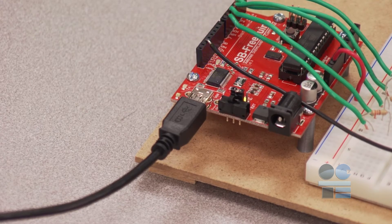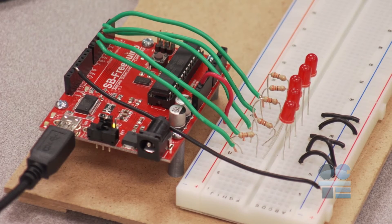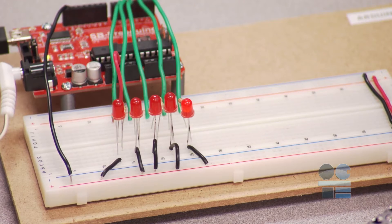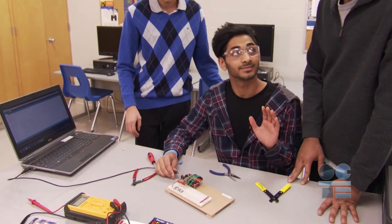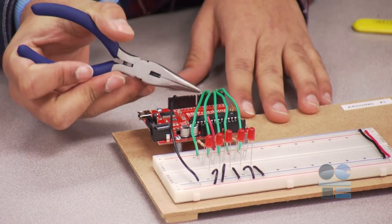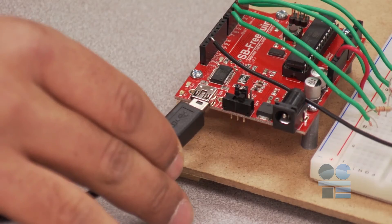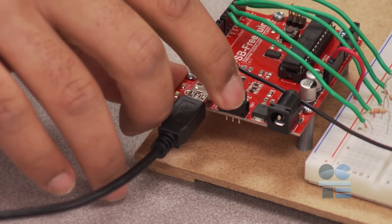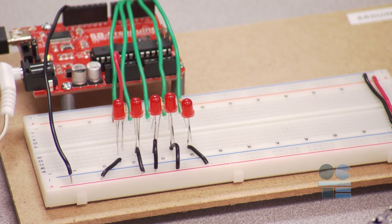Don't be disheartened if something isn't working — it's how you learn. If there is a problem, you now become a detective and must troubleshoot. First, find whether your problem is software or hardware related. Rule number one is to shut off power, and if you are going to remove wires or components, remove the power source to prevent accidental startup and shock. After checking your code, check all wires for breaks. Replace LEDs if they didn't light, and check if you have all wires in the proper connected holes. When troubleshooting is done, re-energize the circuit. If you still have problems, test your circuit with a voltmeter. Be careful of the leads — don't short circuit your wires or components.